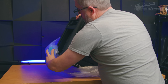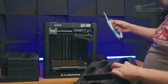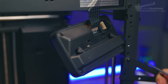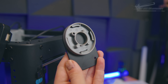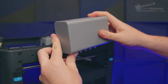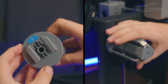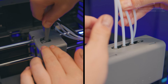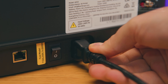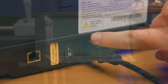Hi, I'm Ross and this is Firehammer Videos. This is a brief one. The machine arrives mostly pre-assembled — really you just unclamp the LCD and slide it into its mounting socket, attach the filament feeder arm to the right-hand side, push and twist the feeder to lock it into place, attach the four spring-loaded filament winders, connect the four PTFE tubes and the hub in the top of the hot end, then plug in the power cable at the back and switch it on. Setup done.